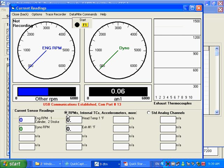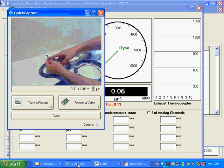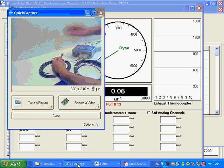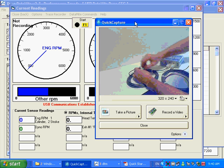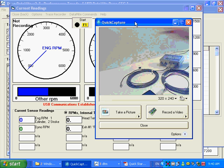Now let's show how to quickly troubleshoot RPM channels. Here we have a magnetic sensor — the small 5/16th-inch amber one — which will trigger on either side of a magnet. When you wipe the magnet back and forth across it, you get a response. We have larger diameter sensors that won't trigger on one side, but with this one, swiping the magnet fairly quickly gives you a reading. If you move it too slowly — like turning a dyno wheel very slowly — you won't get a response. You've got to move fairly fast.